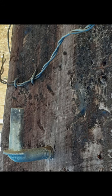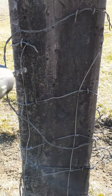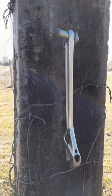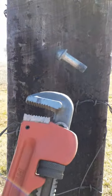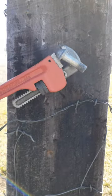Measure from the center of the hole to the center of where the top hole's diameter will be, then repeat the process for the top pin. Install the pins with a wrench and tighten them — clockwise is tightening. Leave enough space between the post and the pin, about 4 inches, so the gate will move freely. Make sure both pins stick out the same distance from the post.